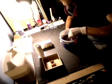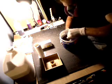I don't like doing that because when you stretch it and pull it, it's the same problem. You're going to introduce air into that mixture. And you know, it's tempting to mix it vigorously, but the more vigorous, the more air gets into the mix. Fortunately, air bubbles rise out of this fairly well, given enough vibration. So once these are poured, I'll be able to do that.